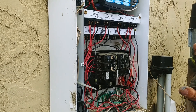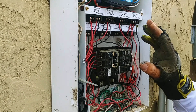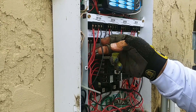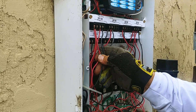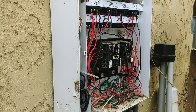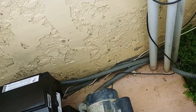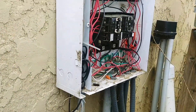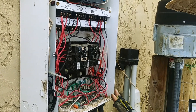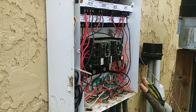I don't recommend that you mess with this part. Probably have an electrician do it, unless you're an electrician. I'm going to explain what I've done. This is the filter pump relay. What we're doing is removing the wires off the load side of the filter pump relay and attaching them to the breaker, so the pump is hot all the time. The one that goes to the pump is this one here, and we're going to attach those wires directly to a breaker. Make sure before you do anything, you turn all your breakers off so you're not dealing with any hot wires in here, because it can be very dangerous.